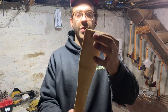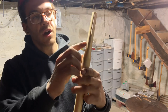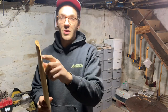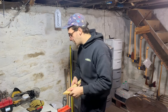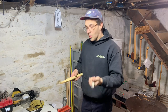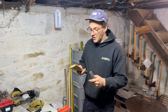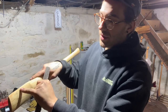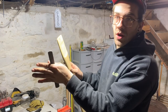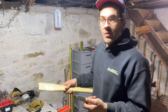Now you can see the depression on the wood and where the head stopped. From what I can see, we don't need to remove too much wood — it's just hung up a little bit. Where the head catches on the handle is where you're going to remove a little bit of wood, and where you don't see any depression you don't remove wood from that spot. You can take a Shinto rasp, a shoemaker's rasp, a four-in-hand, or even sandpaper. We noticed the head was actually tipped more closed on one side, which could be why we got a depression there, so there are just a couple more things to look at.